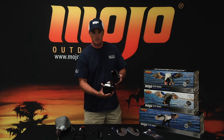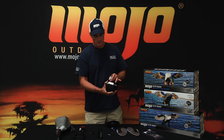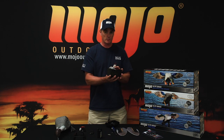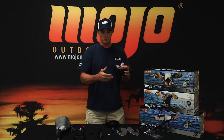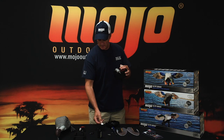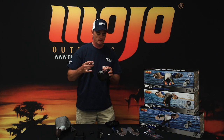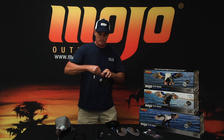You open the top and you can see the wiring harness. Here we have this quick connect plug. Right now we have a loop wire plugged into the white plug that allows it to run continuous. Unplug the loop wire, take the receiver for the remote, and plug it into this quick connect plug. It can only plug in one way.